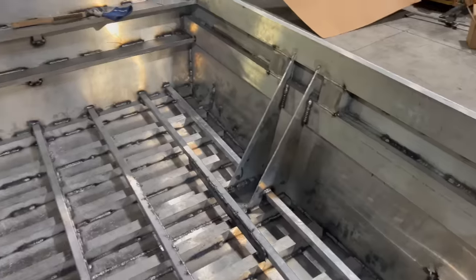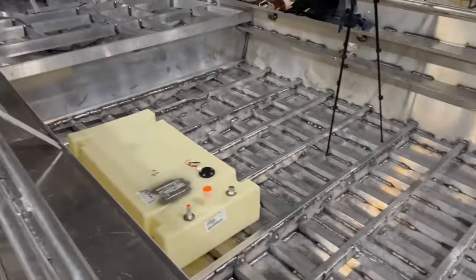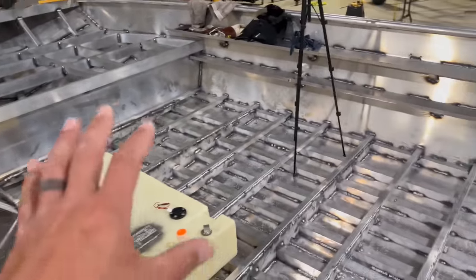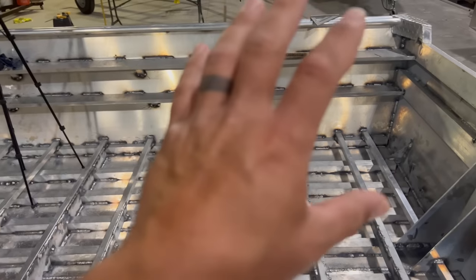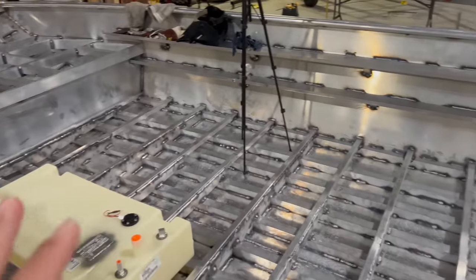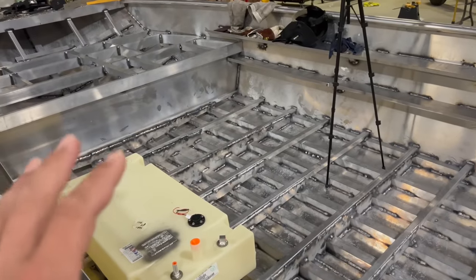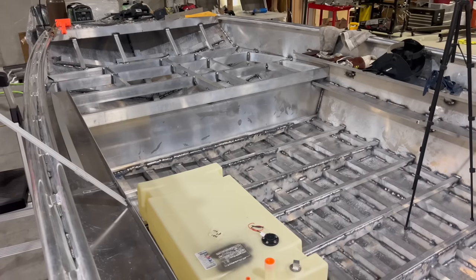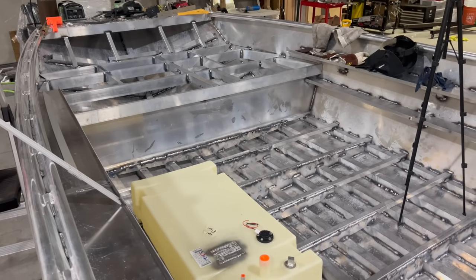This thing's coming along. I just ordered the tough coat kit, essentially. So we'll do muriatic acid everywhere I can rub it in to etch into the aluminum. And then I'm gonna apply their primer for metal. And then I'll apply the top coat. It's a textured non-slip, but I'm just gonna do it all over the interior.